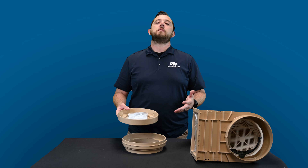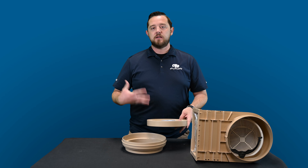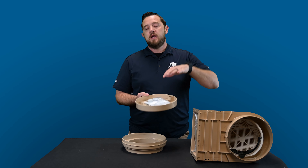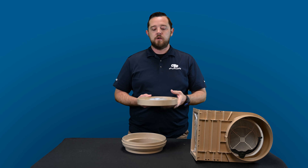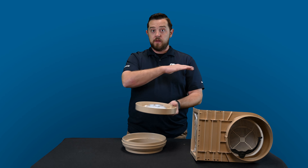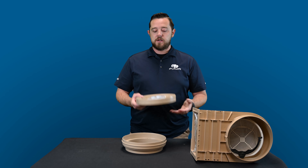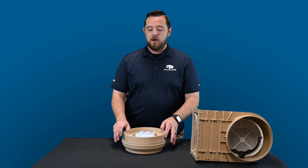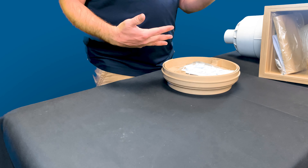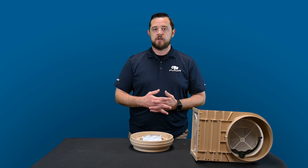For those of you who don't know what a pour lid is — when you want to do travertine, pavers, or some sort of decking aside from a traditional cool deck and you don't want to see this lid at the surface, they've actually allowed you to do a concrete pour lid where you fill it up with concrete to make it flush and level with the surface of whatever pavers or travertine you choose for your decking. It's really nice that they give you that pour lid all in one. The pour lids aren't too expensive, but having it included with your skimmer now saves a lot of time, especially if you hire a different company to do the decking. Now you don't have to purchase an extra part.